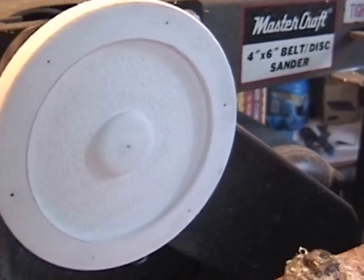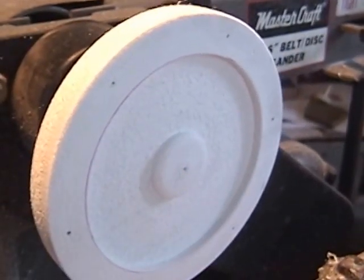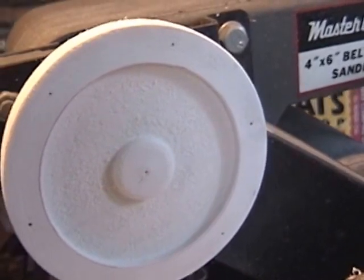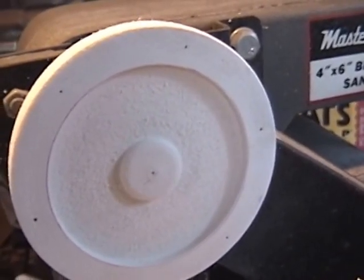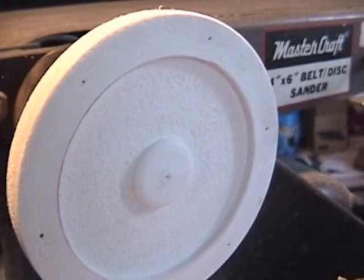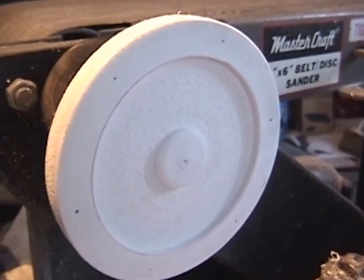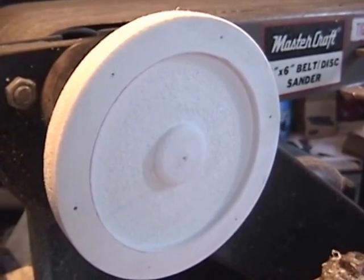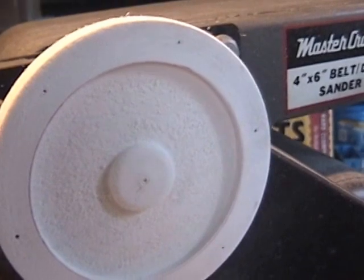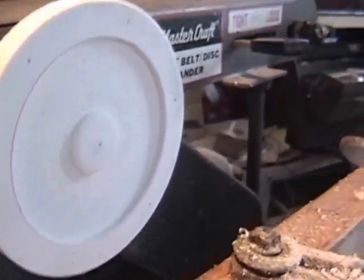All right, here we have the cylinder end plate. I don't know if you can see the 6-hole bolt pattern. I'll go drill that out pretty soon. But the holes disappeared like I wanted. And I'll dismount this, drill this out for the correct size 1/4 inch clearance holes on that 6-bolt pattern. Sand it down a little bit. Give it the old once over.